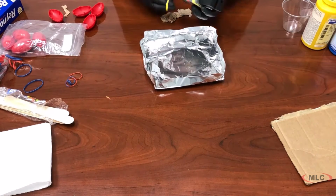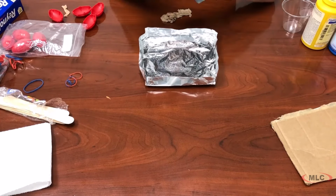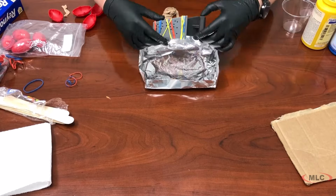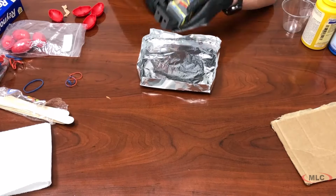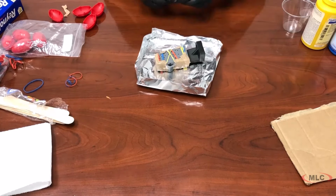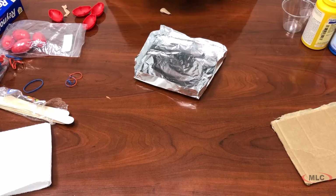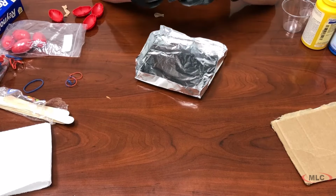The next step is to rubber band or use some kind of clamp to hold the two halves of the mold together. And as you can see, I am not holding back. I'm using all the rubber bands that I have available, really getting it super tight. And then I'm taking a bit of silicone putty. This is just silly putty that I have available. And this is a step that's not necessarily mandatory, but I'm going along the parting line and sealing it, just an added step. I'm going to show an example later where we actually designed a channel inside the mold that allows a bead of that putty to be run through, so you don't have to do this step.